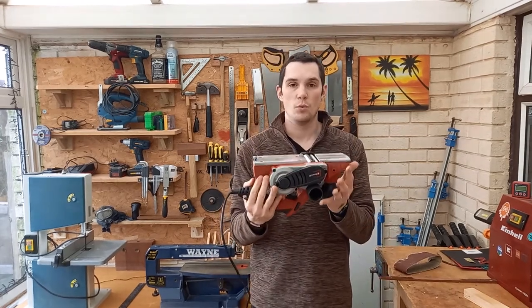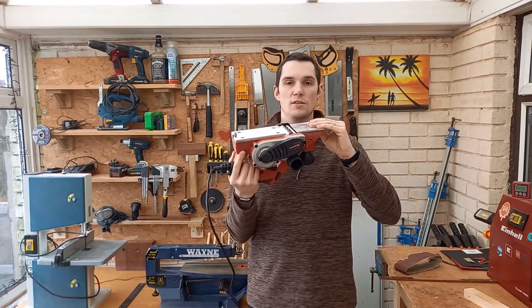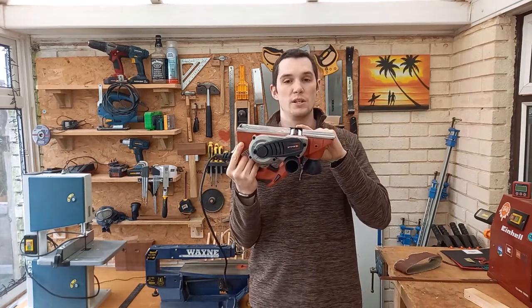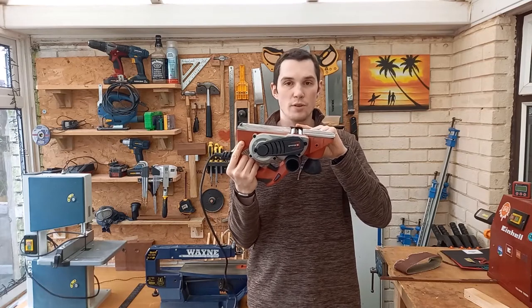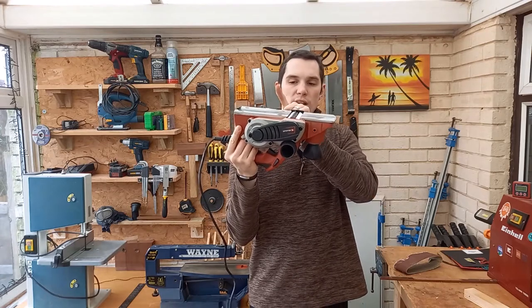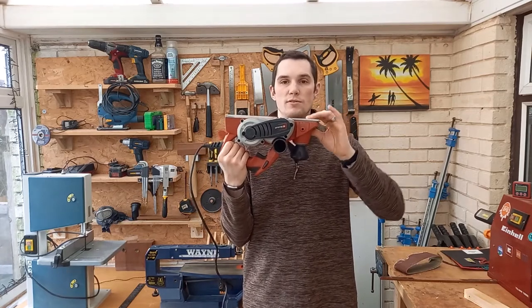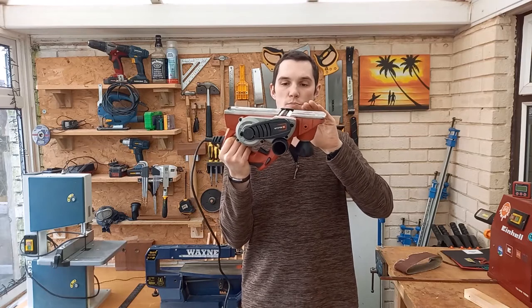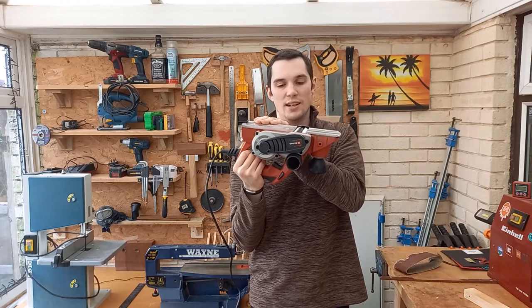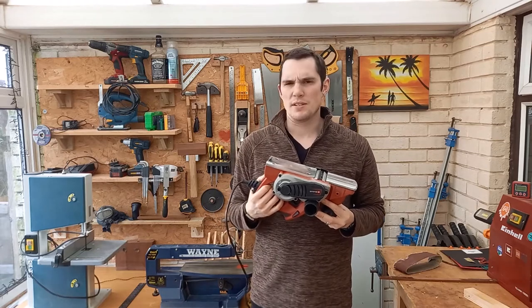The way the planer works is that you have your front plate here. This is the piece of metal that the wood rides along, then it comes to a very fast spinning cylinder with two blades in it. Basically that chops through the wood and then references this piece of metal here. So as long as this front piece of metal is flat on your piece of wood, and once the wood has passed through the blades you keep the back bit flat against it, that gives it the proper reference point for the blades. I hope that's making sense because it doesn't to me!